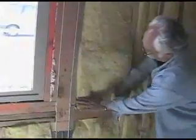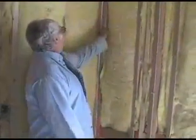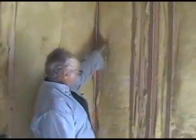There's a little wire right here that messed things up. What they should have done was split the insulation — put some behind the wire and then in front of it — so it doesn't compress. There you go. It didn't take long; it's just attention to detail. These guys need to understand what's going on, and there's somebody coming behind them who knows what they're doing and is going to hold them to the line.